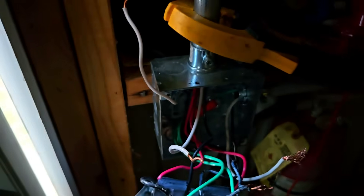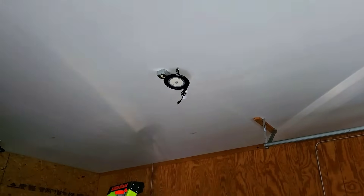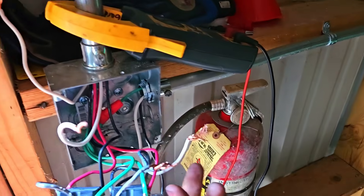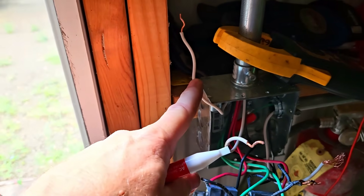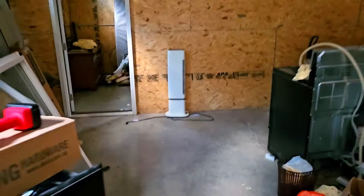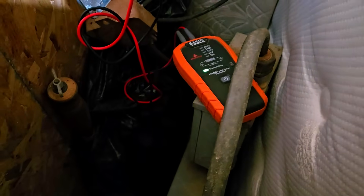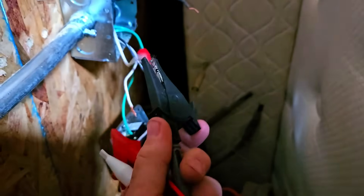This is where my loaded neutral was — the first one I told you about — which is that circuit I just showed you. This neutral doesn't need to go anywhere else, it only needs to stop right here. This other neutral is the one I needed to carry up to these lights to have them switched. But this neutral right here goes to my GFCI. So GFCI circuit seven was coming here, and circuit four neutral was coming here. And there is my Klein ET450 — this is the transmitter part, it's transmitting. I put it on the ground and on that neutral and it's sending a tone out — that's how I found it.